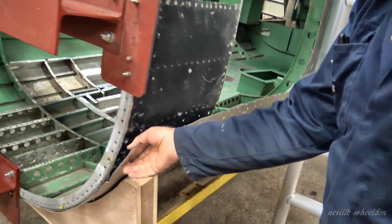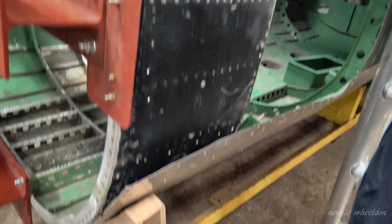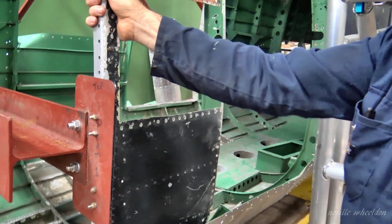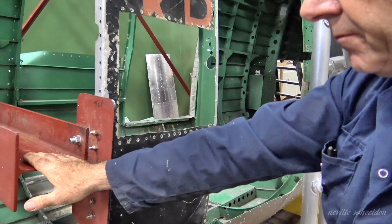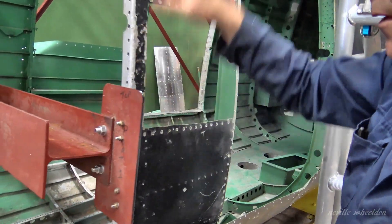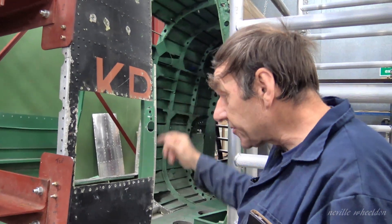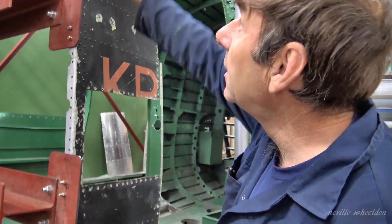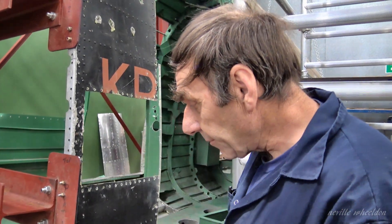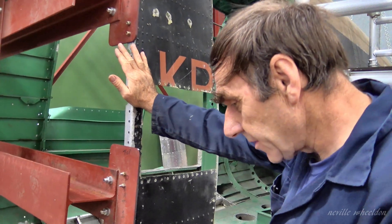Really, really thick commercial aluminium wrapped all the way around there was keeping it absolutely rigid. When we tried to fit that on Monday it wouldn't line up, so what we've done is taken skins off both sides, which has relaxed it and allowed us to actually line it up, because it got slightly damaged in the accident at Woodford.